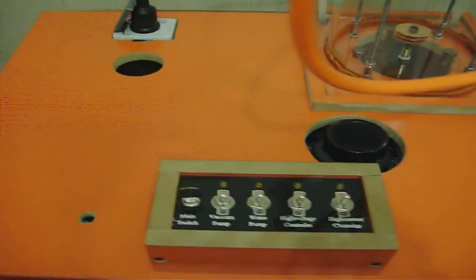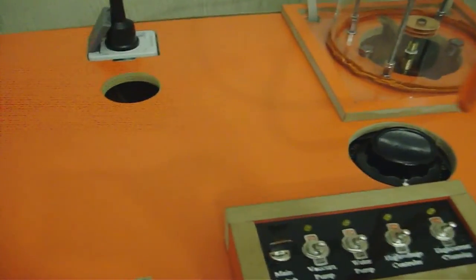Welcome to the second part of my video. As I already promised, in this part I will show you the internal organs of the machine. Here you can see a vacuum pump, and on the right side there is a basket with a few liters of water in it and a water pump. It is a black thing down there, connected to the cathode through these hoses. It delivers water to the cathode and prevents it from being overheated.